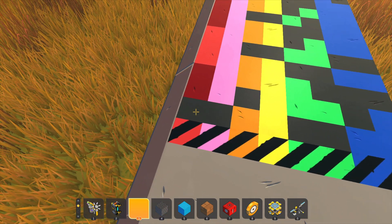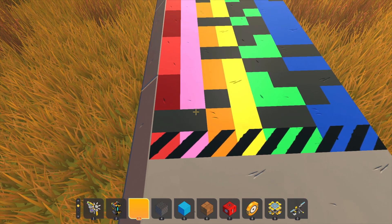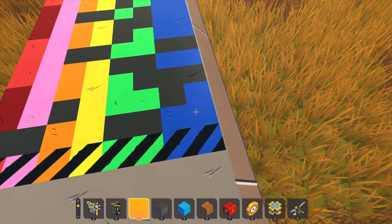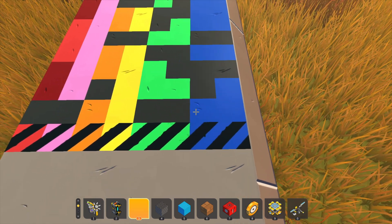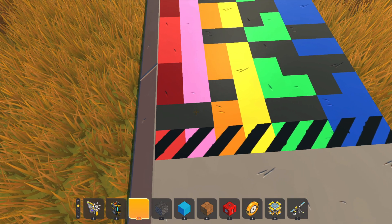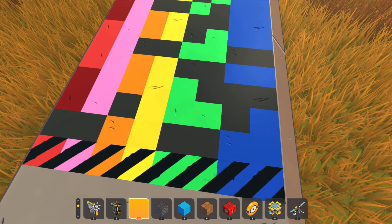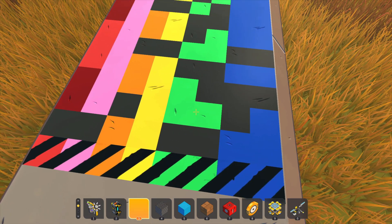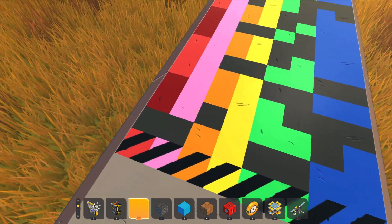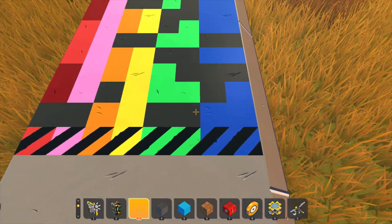The red bit originally was going to run a home command for the head, however we discovered that the pink bit can do the same functionality so we ended up disconnecting the red bit. So if we look at this command here it reads: don't move the head, move the bed forward, print in plastic, and then bring the print head all the way down to the base. The next line actually gives us the X Y coordinate for where the head needs to move — X is the first four bits and Y is the next four bits. Then it tells me how many times I'm going to repeat this command.